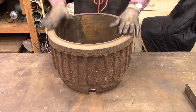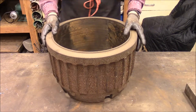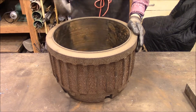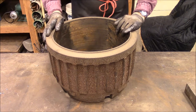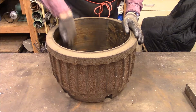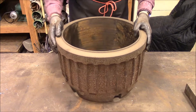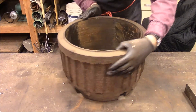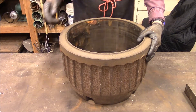This brake drum is actually out of round. It got a little rust on it yesterday when I took it out — it was raining. But when I took it off, the wear pattern is shiny here, and then it hits this spot where it's skipping, and then it comes back here. The same thing happens over on this side right here.